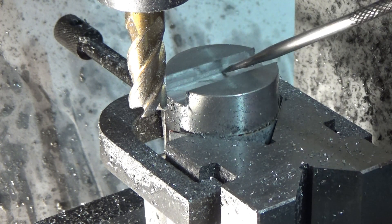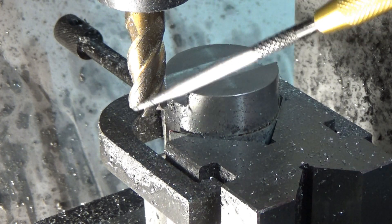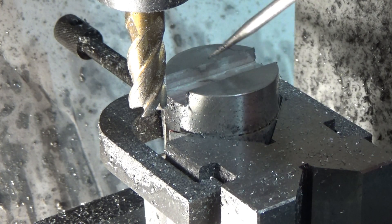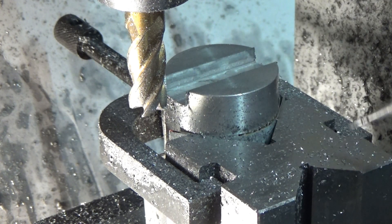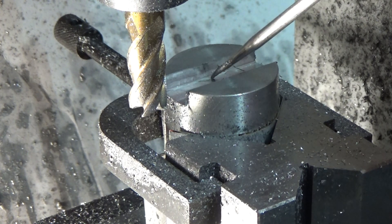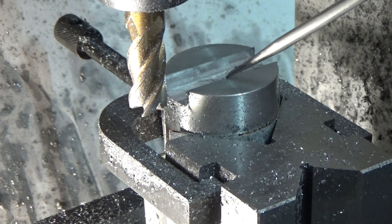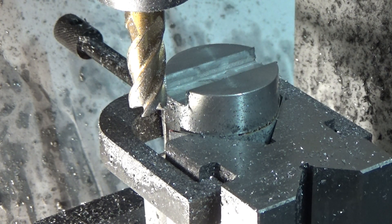I was using WD-40 as a coolant and an aid to prevent micro-welding on the end of the cutter. But as I got deeper into the groove it seemed to be getting worse because it was making the chips stay in the groove, and without flood cooling it wasn't exactly washing them away. So I tried an experiment — I tried a two-flute cutter and that was no better. So I'm back to the four-flute and I'm just using a bit of light air pressure to blow away the chips before they get dragged back into the cutter and recut. It's working very well — I'm very pleased with it. There's a bit of a drumming noise because it's an interrupted cut going over a centre-drilled hole in the stock, but we'll take another cut — we're almost to depth now.